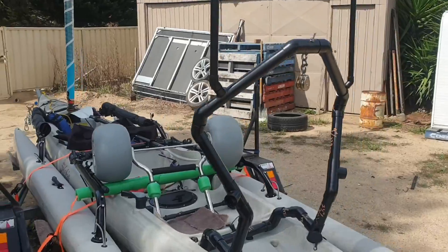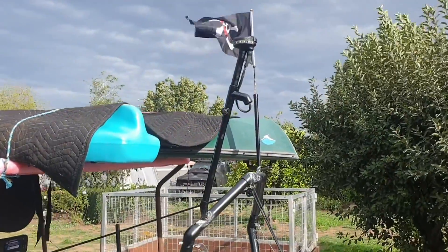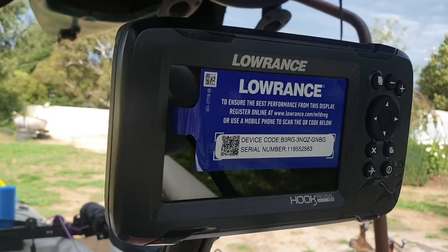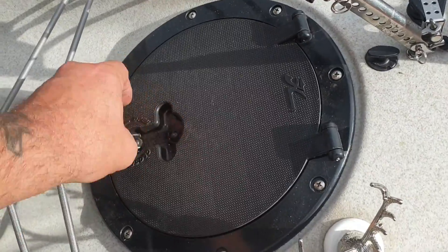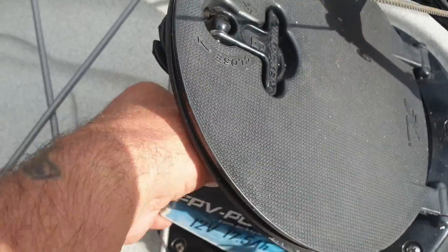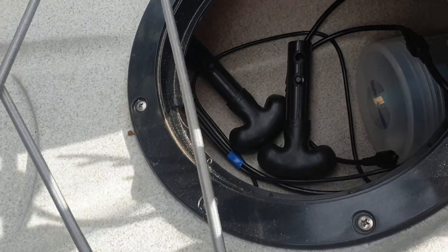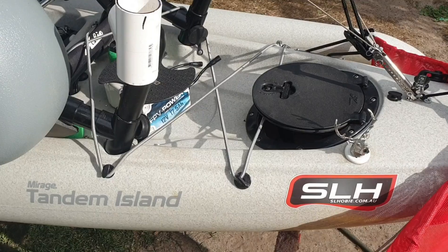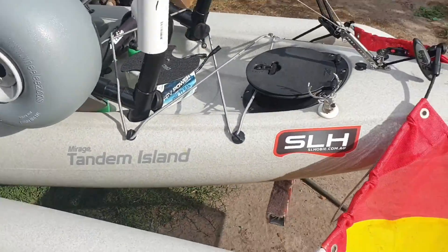A couple of days after a trip to SLH, grabbed a couple of items. My night light is all hardwired in now, and my Lowrance fish finder chart plotter. Getting into this rear hatch - got the battery mount and two of these beauties. I've still got the 7 amp hour one mounted in there. The 7 amp hour runs the light - I've just had it running non-stop and got nearly 37 hours out of a fully charged 7 amp hour battery just running that light.